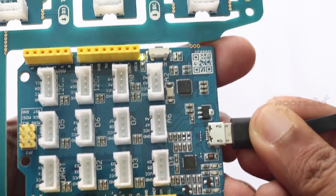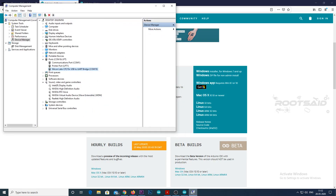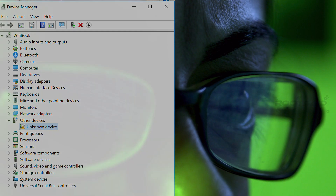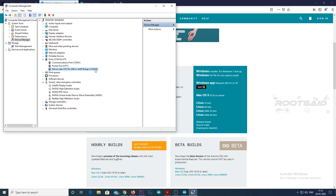You can connect the board to the PC using a micro USB cable. Most of the time on a Windows 10 PC you won't have to do anything else — it will automatically detect the board as an Arduino Uno. If the driver is not installed or is installed incorrectly, it will appear as an unknown device in the device manager. At that point the driver should be manually installed. I will share the link to the USB driver and instructions in the description below.